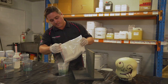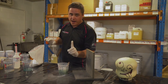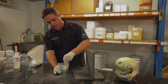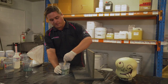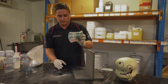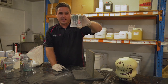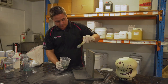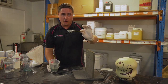Remembering that there is still only 150 grams of resin — that's very, very crucial. Give that a stir. As you can see, it starts to really stiffen up and turn into a paste. So glad that worked — it doesn't fall down. What's that good for? Stuff that's overhead. What it also means is if you put it somewhere, it's going to stack. That's the beauty of this bog.